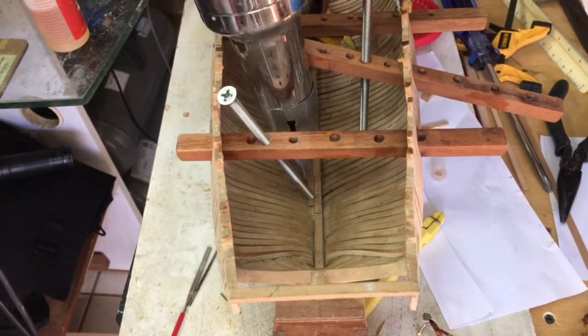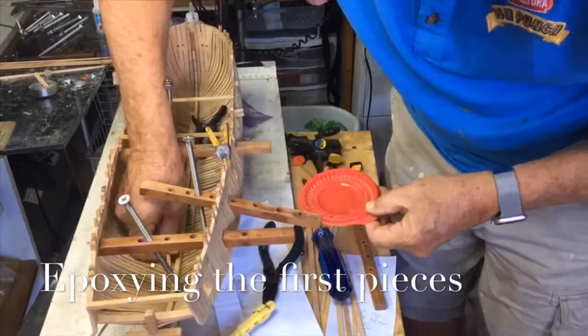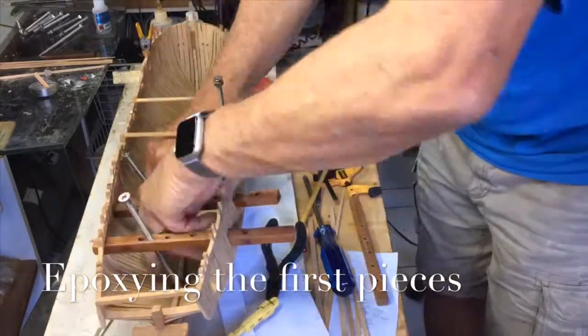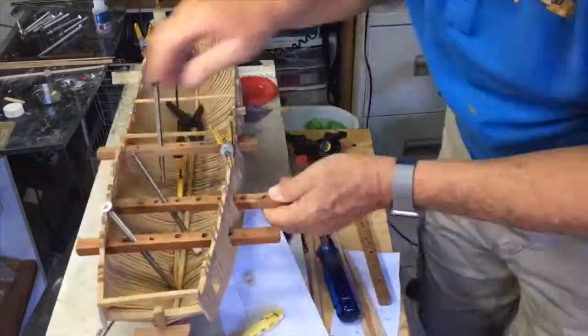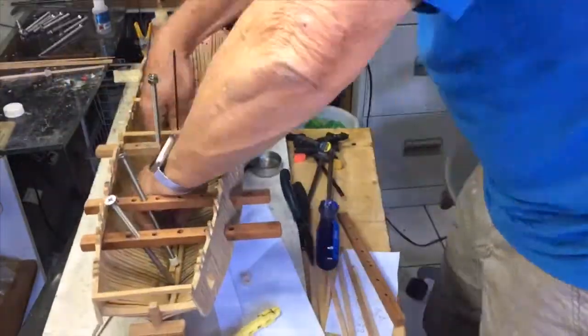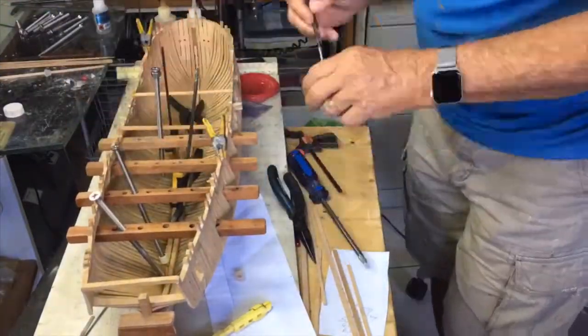I will just say that you should be careful with heat. Remember, the heat is applying to all the pieces of wood, including the ones that are already stuck. So I tend to apply heat for not too long — maybe 20 seconds at most — and do it repeatedly a few times until I'm convinced the piece is dry. Then on to stick and clamp.